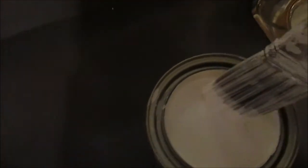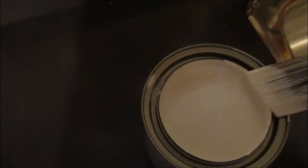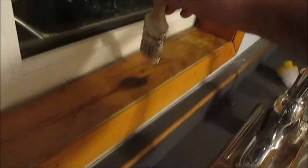Before painting wood trim, look around and see if there's any knots. These knots will bleed through unless you use a proper primer that works to seal them. This stuff is very strong. All you want to do is dab some on just the areas that have really bad knots, because they will continue to bleed through even after you have a couple coats of white paint on.